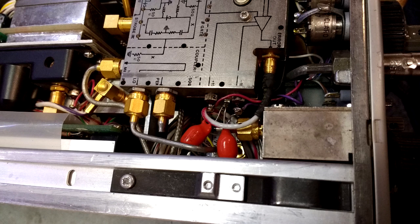Many of the suspects are inside shielded compartments, so the shields must be removed and likely caps measured with an ohmmeter. Good caps on supplies other than the shorted one should measure several hundred ohms or more. A cap that shows a fraction of an ohm is either bad or on the shorted supply. Lift one lead of the cap and test it for a short.